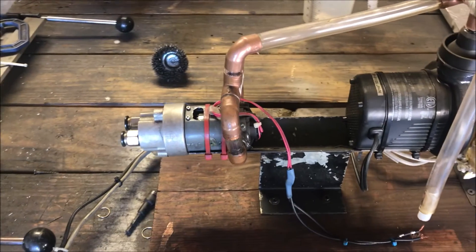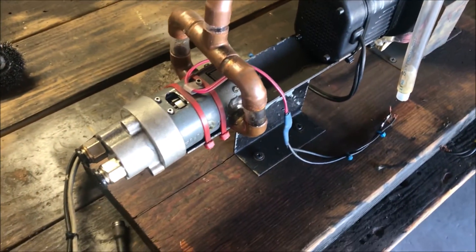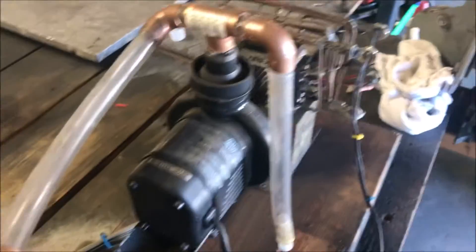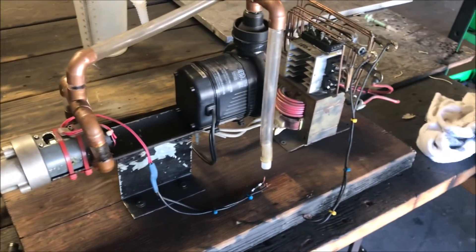We're getting into a thousand-dollar repair on this machine. I'll publish this and buy a bunch of hardware. Back to the subject of being called an idiot — commenters, you've got to realize I obviously don't run stuff at its rated capacity. Everything is just tortured in this place, so yes I do have to cut holes in my motor casings and build elaborate cooling systems, because that PWM also gets that hot when you're running this motor. Without this duct system on for any long duration, forget about it.